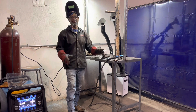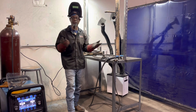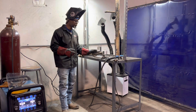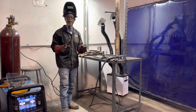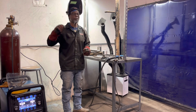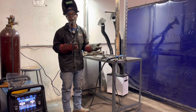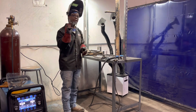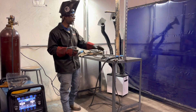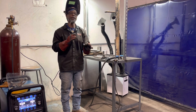Most facilities will make sure they have proper supplies, but sometimes you can get a bad batch of wire or rods — it is what it is. Stay aware of that when welding with flux core. Clean your metal, check your gas flow, make sure you're not welding too hot. If it requires 25 volts, don't run 27 or 28 — that could push the gas flow out. And keep in mind your stick out: on short circuit MIG you want about 3/8 to 1/2 inch, but on dual shield flux core it's asking for three quarters to an inch, and that's done for a reason — it helps the gas actually flow.